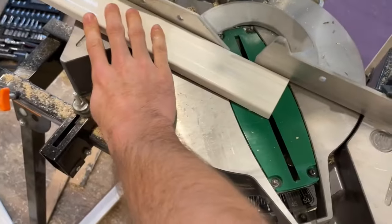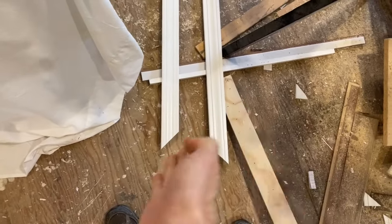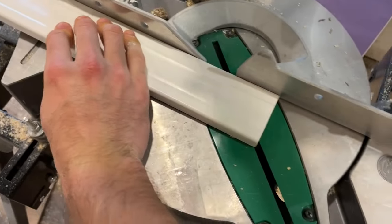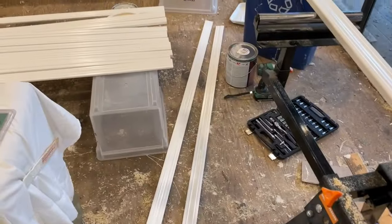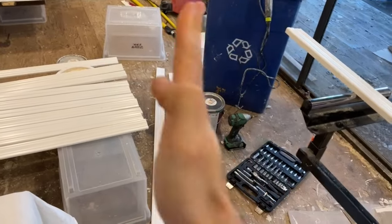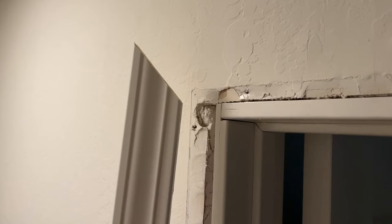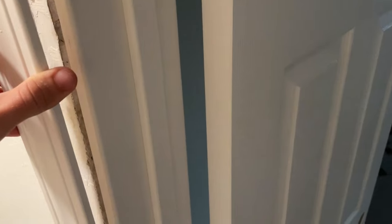I'm going to be cutting the top section. I haven't measured anything yet, but to get these miter cuts — these 45s — it's definitely going to need a cut like that. I'll make this miter cut first and then start measuring to cut the bottom to length, because it's a lot easier to make a precise straight cut than these miter cuts. I've got my miter cut on the casing now and still need to cut it to length.